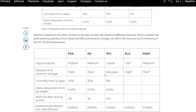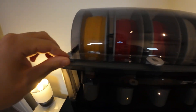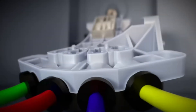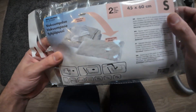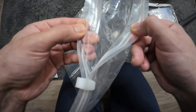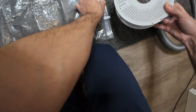Different types of filament have different resistance to humidity. If you have the budget, you can buy an AMS — the advantage is that you can store filament there, print with multicolor, and dry it if needed. If you can't afford that, one of the best options is to buy vacuum bags. This method is used for storage — there are two zip locks to close the bag, and a hole covered by a lid that lets you remove the air. You just need to put your filament spool inside the bag.